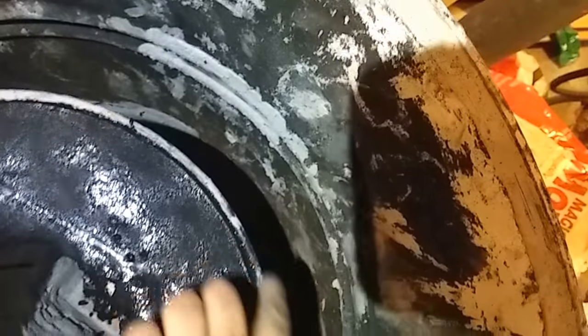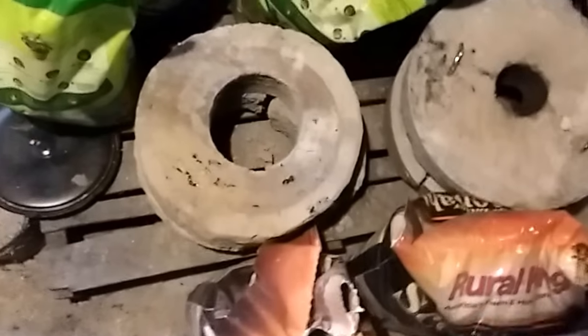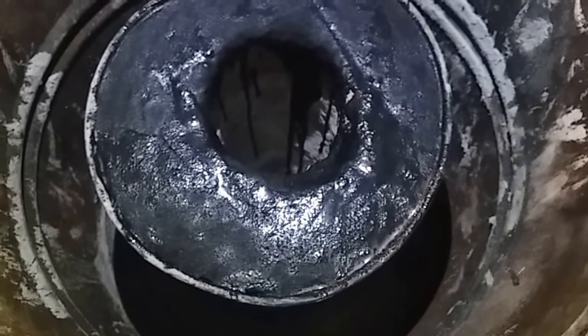Oh, looks like it dripped down there. That won't matter too much. I'm not going to put any of the lining cement down on these outside edges or anything like that. I'll probably do some on this, a little bit around the lip, and then I still get to fully coat this one heat riser on there, but it's coming along slowly but surely.